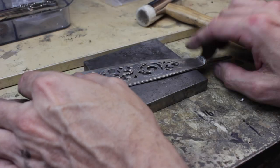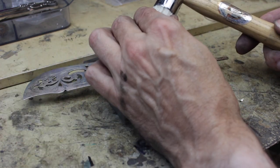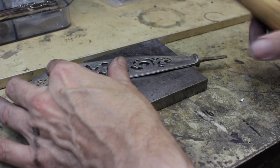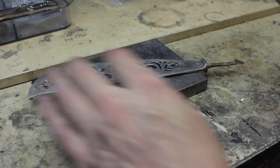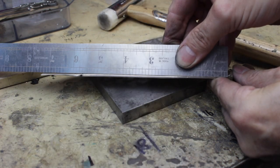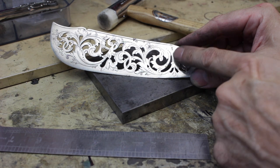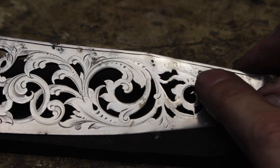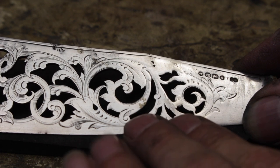Here I'm using a flat steel block and a nylon-faced hammer, just tapping it where the main dent is. This is very slow and very gentle — I don't want to break it, snap it, or put any marks on it that I'll have to polish out later. That's looking pretty dead straight now. Next I want to turn my attention to the area where it was soldered previously — there's a gap in that line, so I'm going to re-engrave that little line, which will make a big difference.